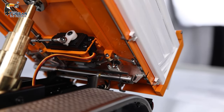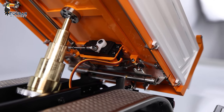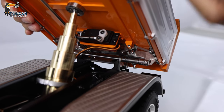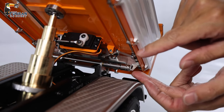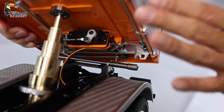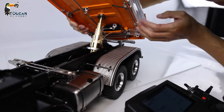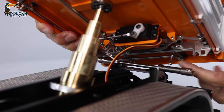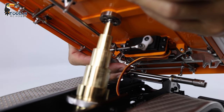That's the right position. If now I drop it, you will see the difference — wrong operation. Now I will unlock — this bucket will drop. That's wrong. But if it happened, let's see how to put it back. So now I will do the wrong operation — now it's on the top rising, I will unlock this side — you will see it will drop. So if you do the unlock operation wrong like this, this bucket will drop. So how do we put it back? Now you're changing back. So this is only locking the right side — this one is already coming out. You see? This side is still in position. Right side of this bar is already out, so we need to press it.